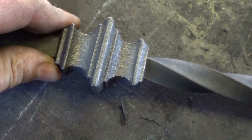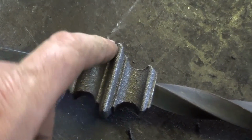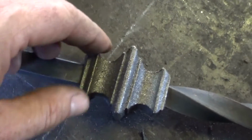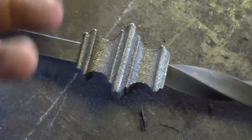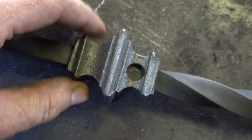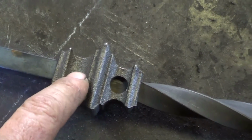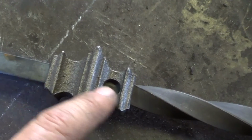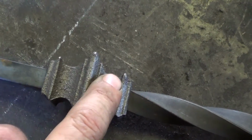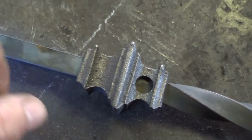Another option that's done from time to time is you can epoxy these, or glue them in place with either an epoxy or even silicone would work or something along those lines. It's just something to keep them in place. I'm probably going to regret this. What we're going to do is I'm going to drill them, and I haven't decided whether to drill opposite sides or both top and bottom, but I'm going to drill these and then we're going to do a plug weld. I actually only need one. I may just do one hole because, again, it just has to hold it in place.